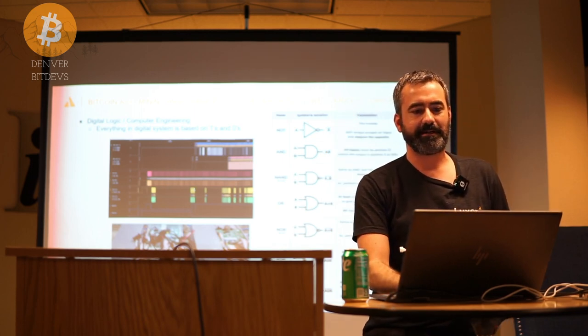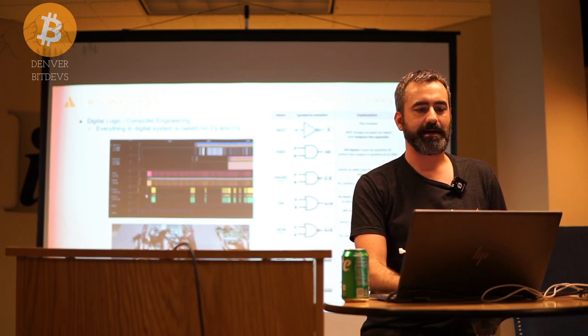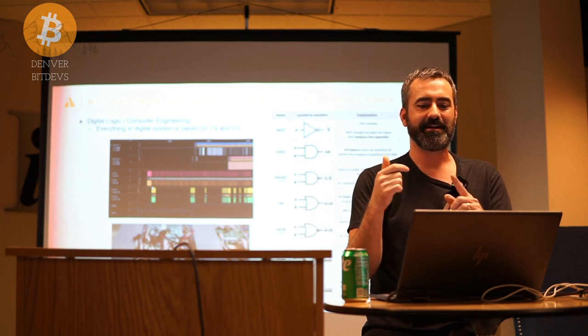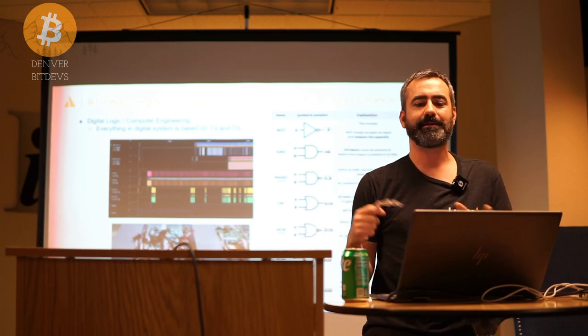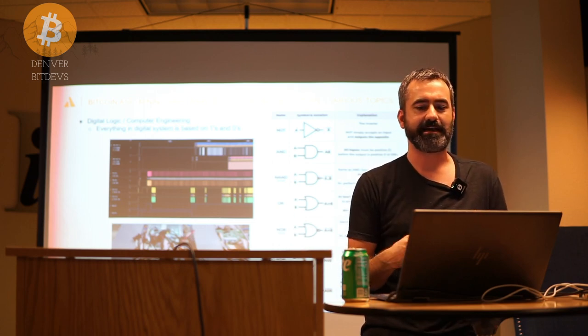I've got the serial bus here, the I2C bus, the I2C to the power supply. There's actually a power supply interface I failed to mention as well, where there's communication from the control board to the PSU over I2C to set voltages, check status, things like that.